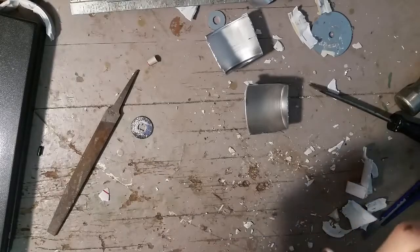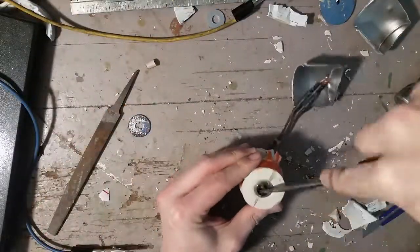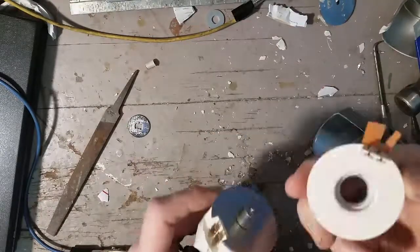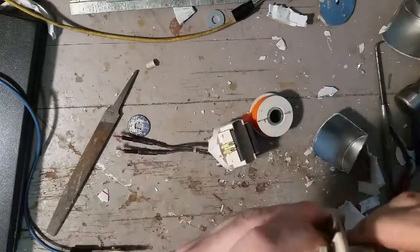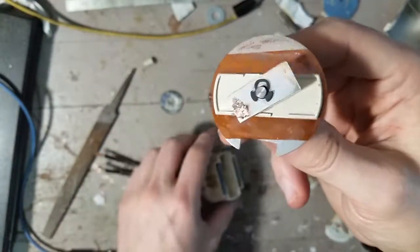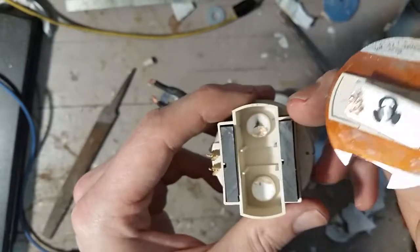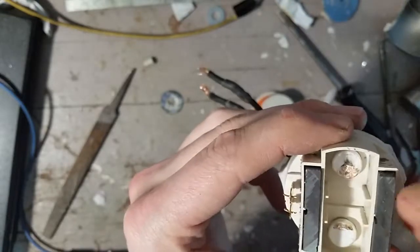That orange bed at the bottom is the coil. It's a pushing coil — there's a rod in the middle, and like an electromagnet it pulls downward, which pushes the plunger to close the contacts. There was a snap ring holding things together that I removed — it didn't really do much. There you have it — copper, a little more prominent in there. What you can see is what looks like an explosion happened: this is silver-plated copper. Silver is an excellent conductor and even silver oxide is a much better conductor than copper oxide, so contacts are usually made this way. You can see exactly how it welded.